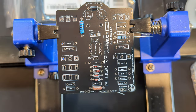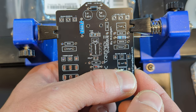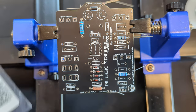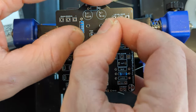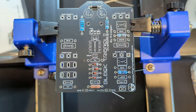Here's a 9.1K — that's for the secondary voltage, I think the 4.5 volts for the op amp. I'm going to add that here. Next is 680 ohms. Sometimes Mouser gets a little crazy when packing. These are nice thick leads, very beautiful resistors. I like to pull the leads to the side. You can pinch them inwards and cut flush — it is important to have sharp flush-cut side cutters.